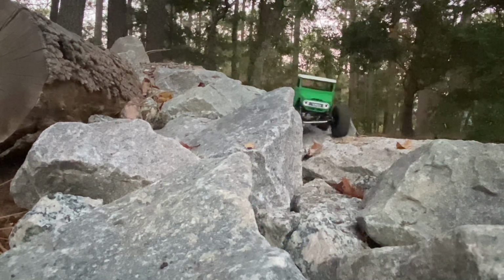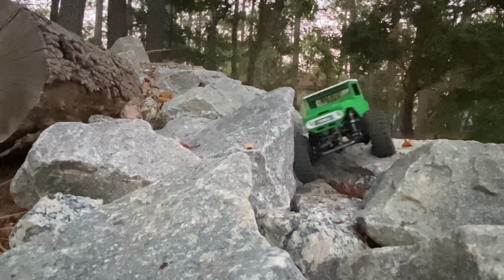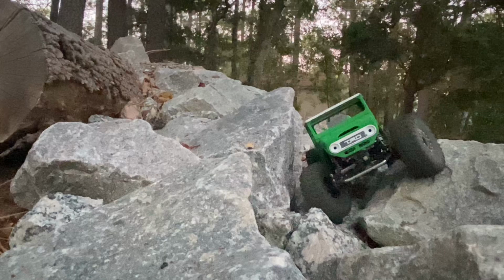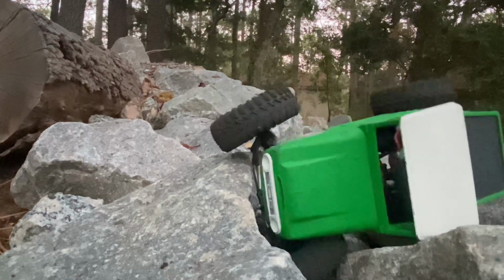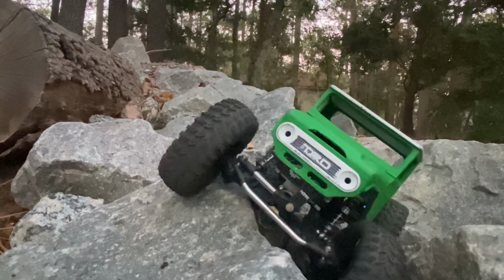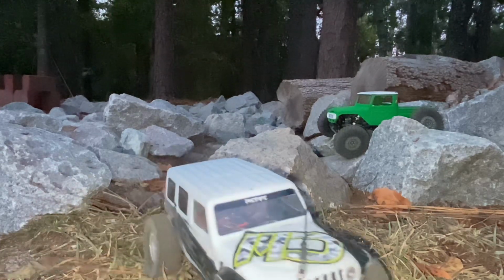You didn't just use some 1050 cold roll steel, like you would for an exo cage, where they don't have to be super strong. The strength comes from triangulating all the positions and making good bracing and all that. The tube itself doesn't have to be super strong structurally. I mean, certain applications, absolutely, race car, but when I built my exo cage for my 1-to-1, we weren't worried about super strong. The thing would take huge beatings and still be strong. It was the way it all triangulated back to itself.